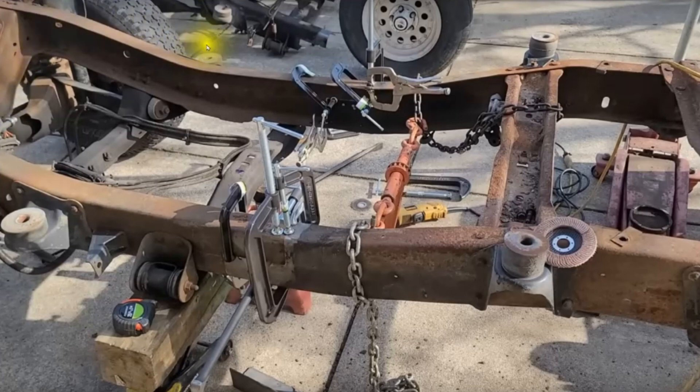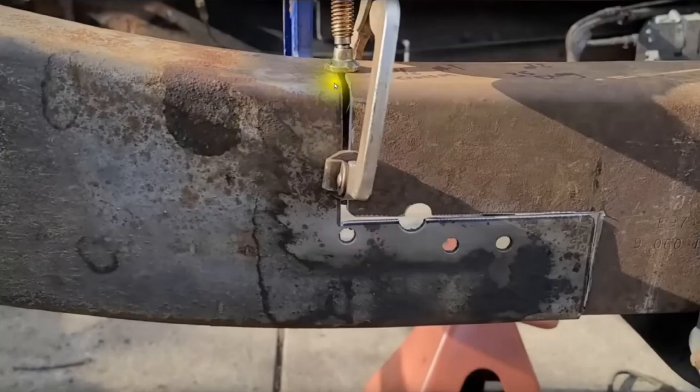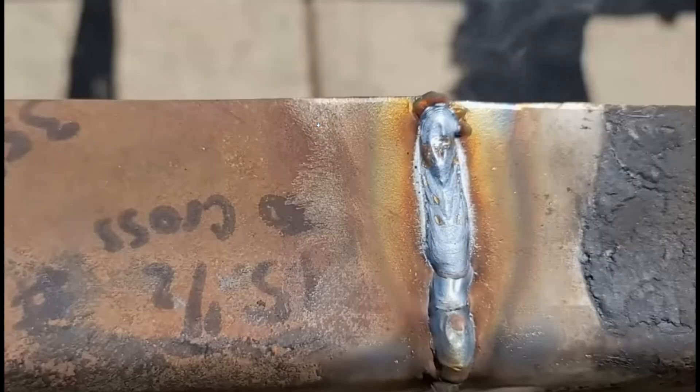I'll now look at cases where people have published details about their chassis repairs on the internet and make my own comments — both the good and bad points. We've got a guy here grafting a new rear end onto the back of his truck, with a big Z-profile cut right through the main chassis members. The chassis members themselves are pressed steel C-sections, which is good because you can get to both sides of the weld. He's done a butt weld all the way around — across the top and bottom flanges and all the way down the zigzag path on the web. On the top flange we can see weld reinforcement on top, and if he gets in behind, cleans up the root, and ensures full penetration — laying another bead if necessary — this will count as a full-strength butt weld.